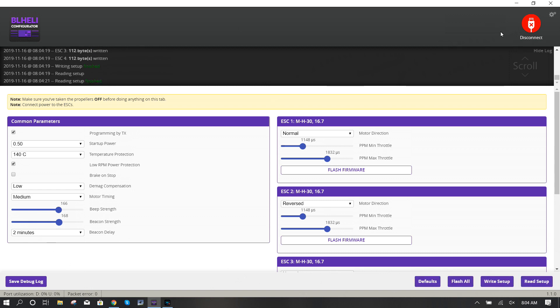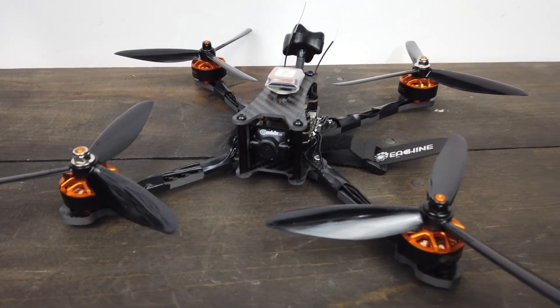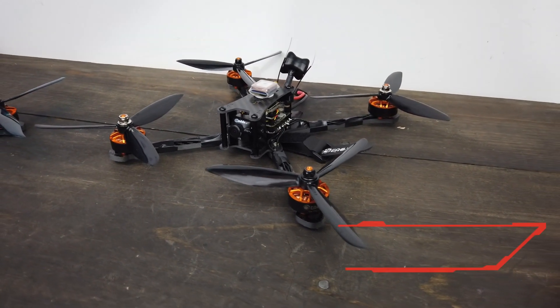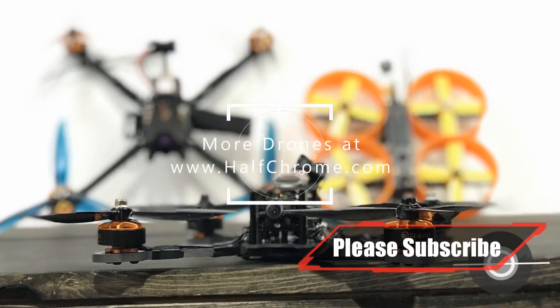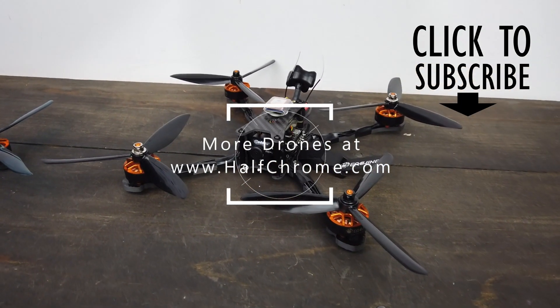Then click 'Write Setup' and go back into Betaflight to verify the motors are spinning correctly - again, props have to be off for all this. I prefer using a piece of paper on the motor to check which way it spins and confirm it's in the correct direction. Hopefully that was helpful - let's get this thing out and fly it. It is fun to fly. Maybe add a different receiver for a bit more long range - that might be my suggestion. What do you guys think about the Tyro 119? Leave a comment below. Thanks for watching, don't forget to hit subscribe, happy flying!